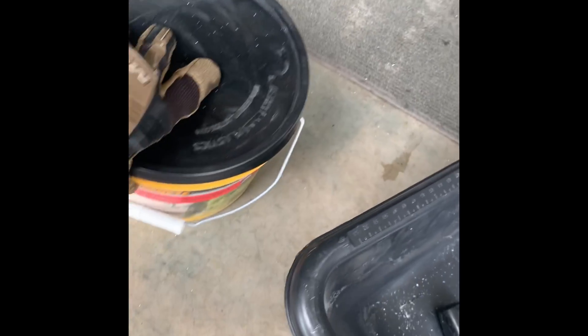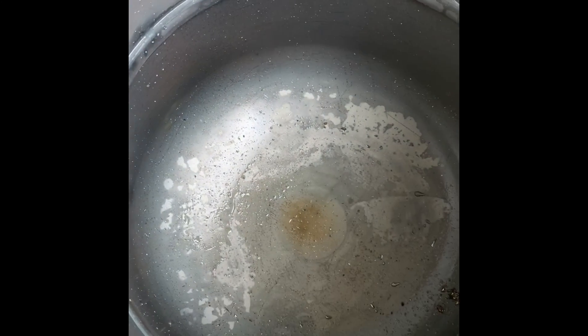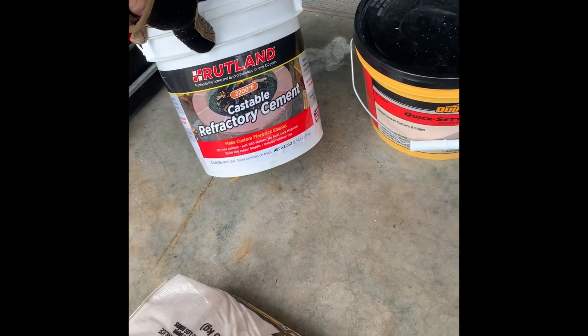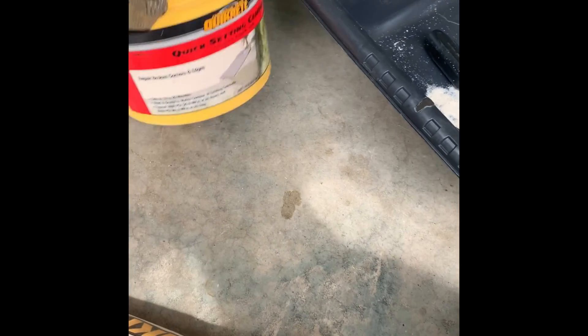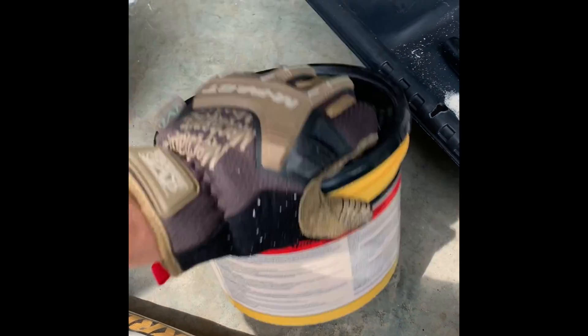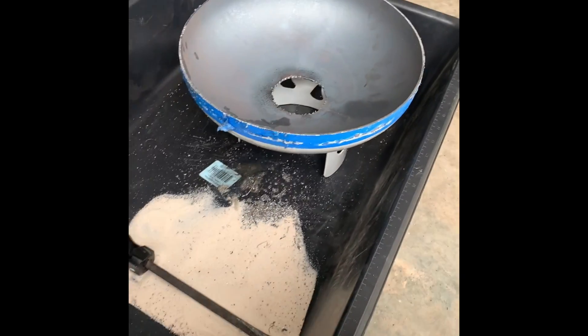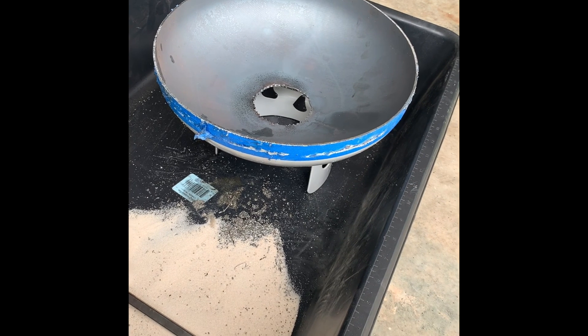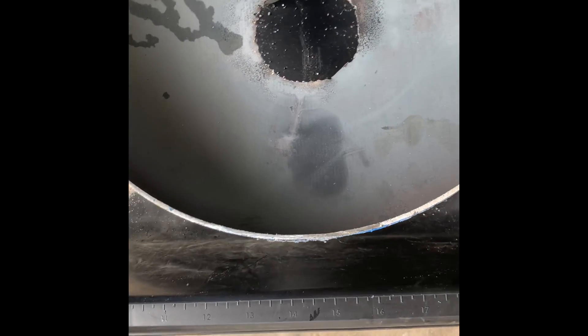What I'm gonna do is mix half and half. I'll put some rocks at the bottom to level it out, put some quick-setting cement with sand mixture, then put a layer of refractory cement. I'm gonna use one of these tubs and just build up around it until I get to the top. To hold the cement in the lid, I've seen guys weld bars in — I think I'm gonna put a bolt through every so often, run a wire around it, and that'll be it for the lid.